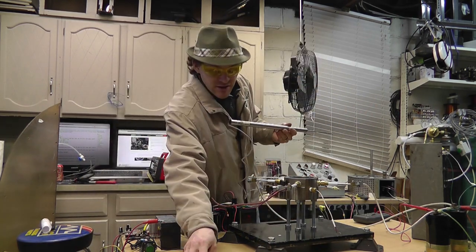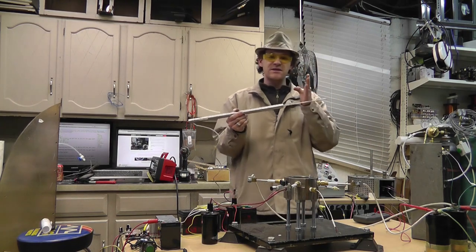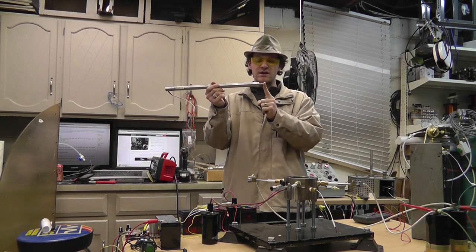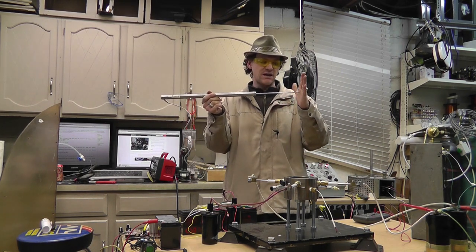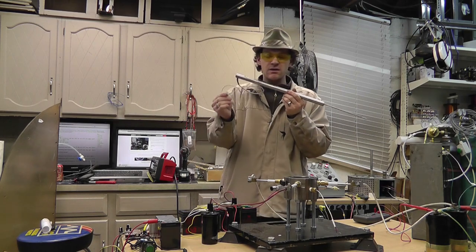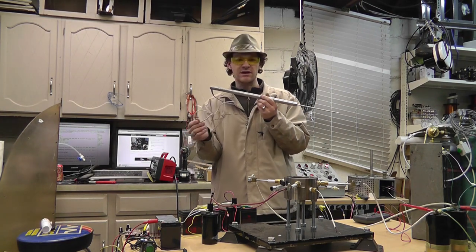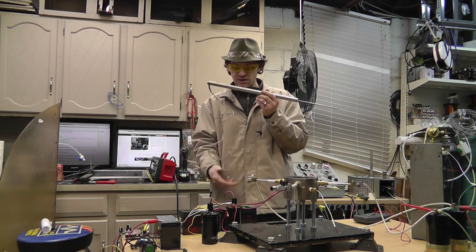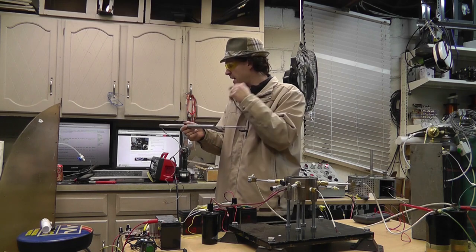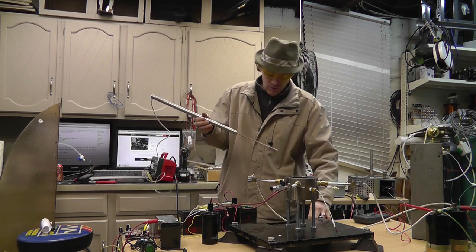Basically, there is an output on this thing, and it will give you a negative 5 to 0 to 5 volt signal. So centering it would be 0. This would be negative 5 volts, and that would be positive 5 volts. Or you can configure it so that the bottom point is 0 and all the way at the top is 10 volts, okay? Now you have to supply this thing, it's got an exciter in it, a signal, 24 volts up to 60 volts, I think, and that excites the element in here, and then you can read your feedback signals, okay? That's actually how this works. I'm going to show you with the oscilloscope, actually watching it move on there, you can see exactly what I'm talking about. So I'll get that hooked up for you, and I will show you how that works.